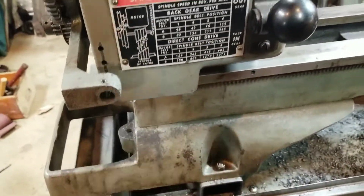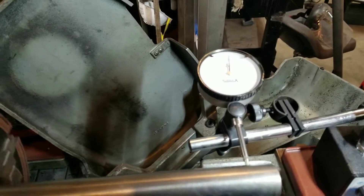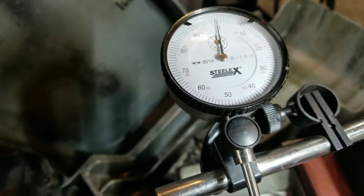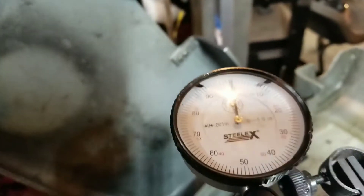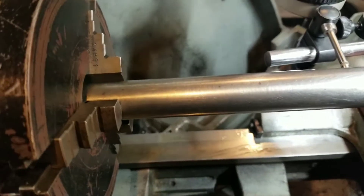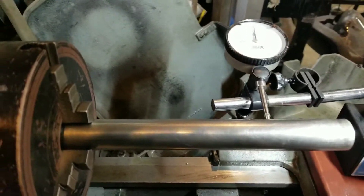On the back side, this one is going to be buried by the gearboxes, so I've got to get this lined up before I put that stuff on there. I think it is lined up — I indicated that in. I don't know if you can see that, so we'll just go slowly towards the chuck. That needle is hardly moving. Wow, look at that — I don't think there's a thousandth in there. It's a piece of steel Mike lent me, because I quickly realized everything in the shop is bent and warped. He gave me a piece of steel that actually is straight — I've got to get that back to him. All right, next time you'll see chips.